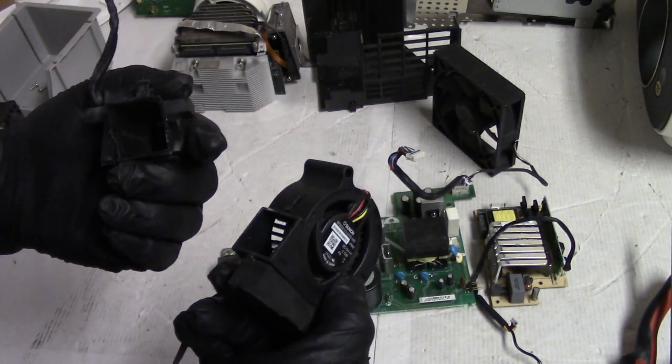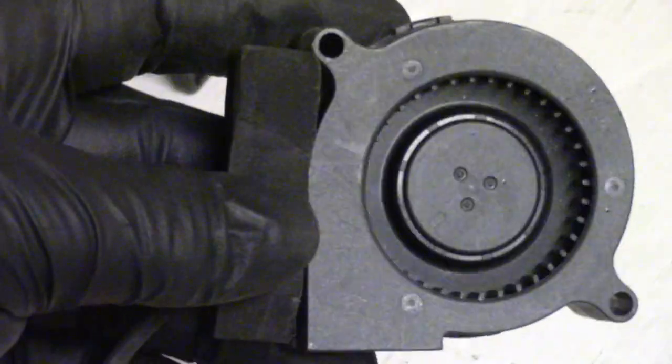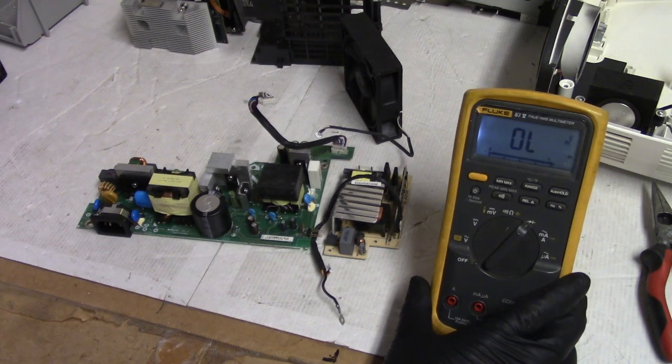So that just comes off, right? Yeah, that's just snapped on there. So we'll set that over there. I don't really need to take this apart. I can just hit it with the paintbrush to loosen everything up, and then we'll hit it with air. We're really just gonna get in here with the brush, and all I'm doing is knocking stuff loose. And then the same thing on the bottom side. And then go hit it with air. Very easy. So after I got all that stuff loose, I just hit it with some air. And a huge, huge puff of dust came out. So that's good. Let's put the vent back on. Like that, that goes there. And then that'll go back into the projector. Okay, there you go, you guys can see it.